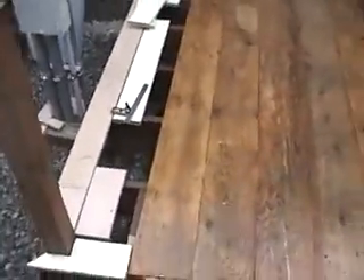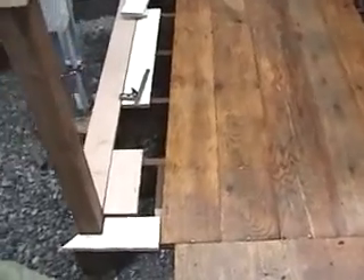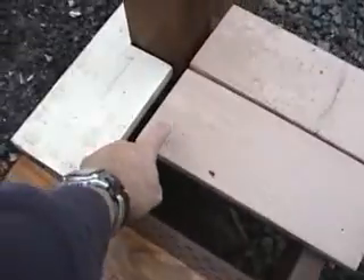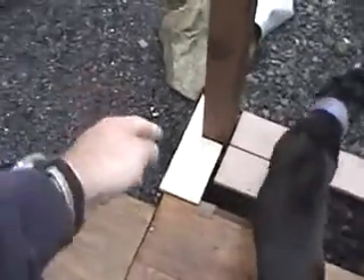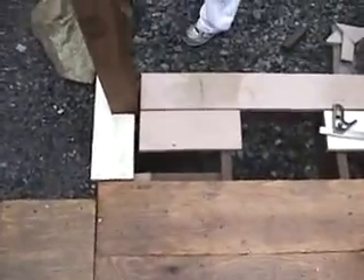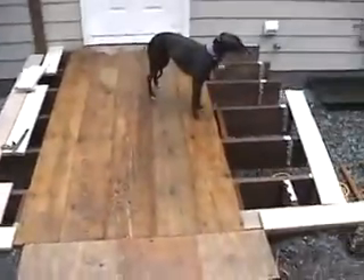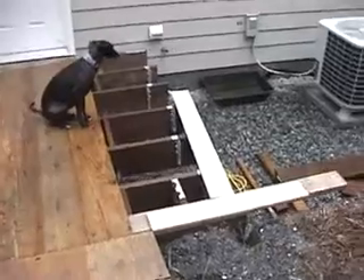Then all the other pieces will be put down from left to right, all just straight cuts pushed up against the house with an appropriate margin. We'll leave the boards that are here and here on down overhanging slightly to cut them in place, putting in this last board here where my foot is at the very end so the cuts will be nice and straight. It really should be pretty quick to do. We'll be working from left to right, north to south, and when we get out here to the far end, we'll cut off these joists at the right place.